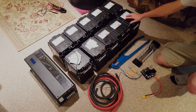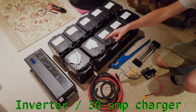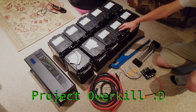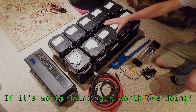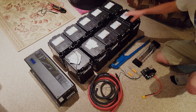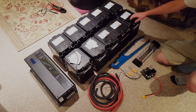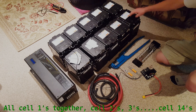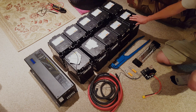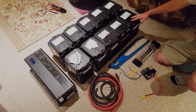We have 10 of the A123 7S modules and a 3000 watt pure sine wave low frequency inverter that we're going to use with these batteries. This is officially dubbed project overkill because in a 2S5P configuration, these will all have their own individual BMSs just to keep track of everything. These batteries can dump on a pulse 138,000 watts.